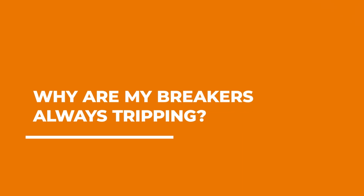Another question we get all the time, especially with those hot summer days, is why are my breakers always tripping? Under normal circumstances, your circuit breakers should rarely ever trip. There's a host of different reasons that can cause them to trip. The main reason that they trip is an overload, so you have too many things plugged in or running on the circuit causing it to trip.